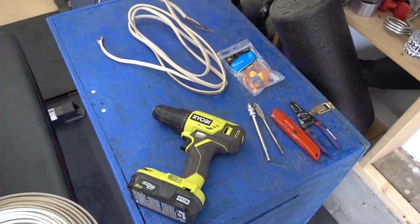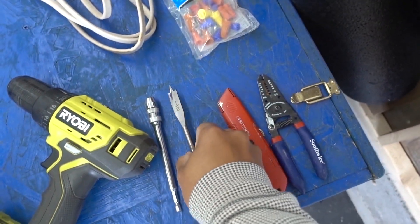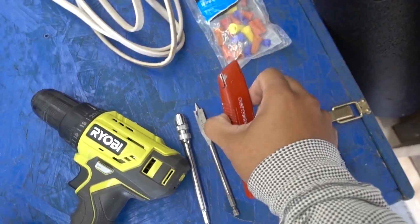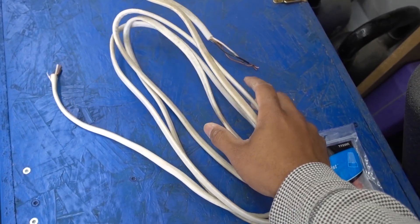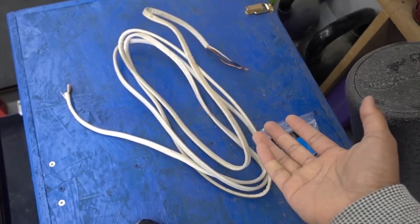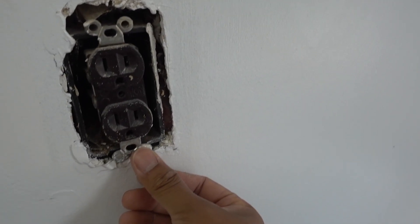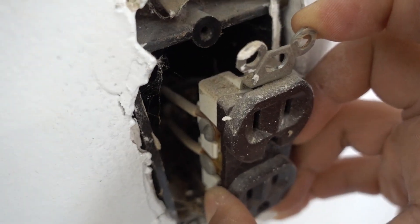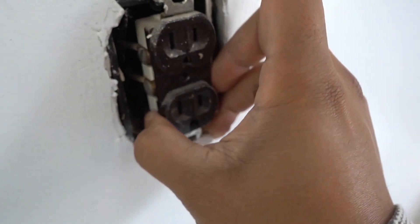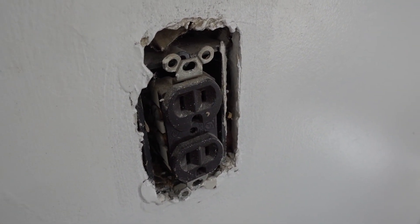Alright, tools for this next step: I've got a drill with a drill bit plus extender, so I'm using a half inch spade bit today, wire cutters, a box cutter, twist connectors for the wires, and some leftover 14 gauge wire. I'm going to unscrew this outlet and see what's inside. So I've got it open now. You can see that the previous installer actually drywalled over the thing so I had to break off a little bit. If you can see from back there, there's actually not much slack, which is kind of a no-no, because now my ability to work on this will be limited, but I'll do what I can.